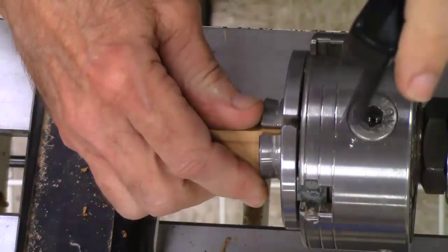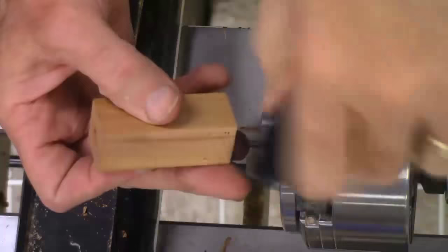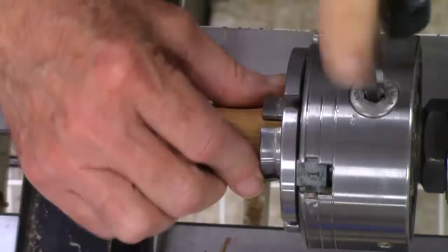Now, when you reverse this, it is not finely milled stock that's gone through a planer or a jointer or anything. Just reverse it exactly 180 degrees so you'll maintain pretty much the same orientation, and then you're a little more likely to have those holes match.